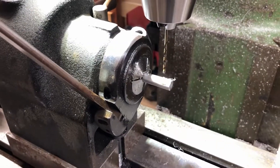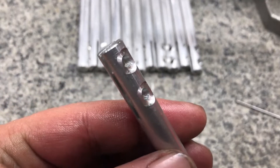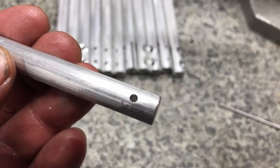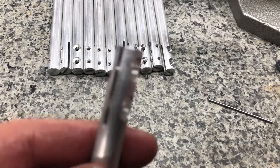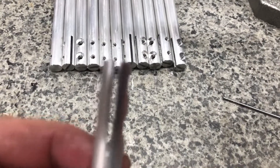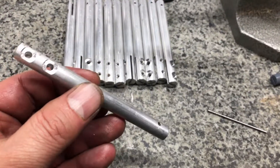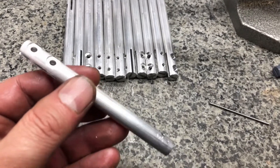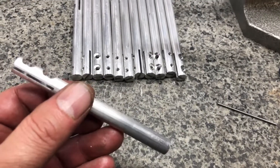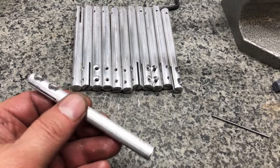That's it for the part — we've got one finished piece. All 12 pieces are finally done. It's a lot of work actually. Here's what one looks like finished. Still have to deburr them, but I'll do that later. There's the hole in the back. I did measure the slot out of curiosity — it's a 1/16 cutter and it actually cut about 67 to 68 thousandths wide, which is perfect for what I need it for. If you're interested in finding out what these are going to be included in — what project or thing I'm building — I did call it a turbine. Stay tuned to the channel and you'll find out — should have some upcoming videos detailing the project. Hope to see you soon.